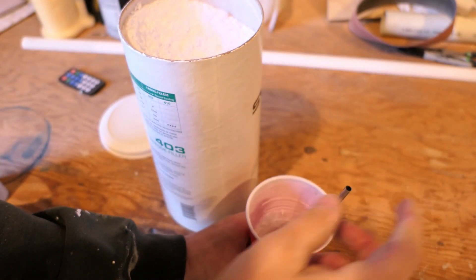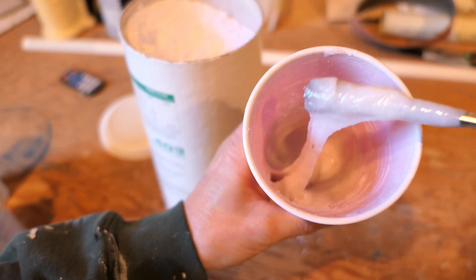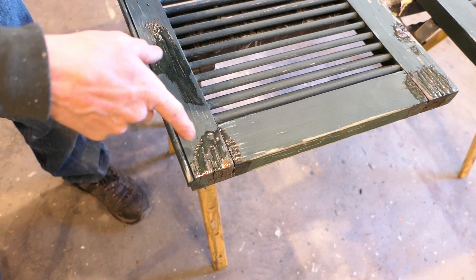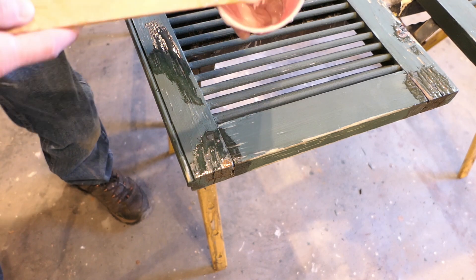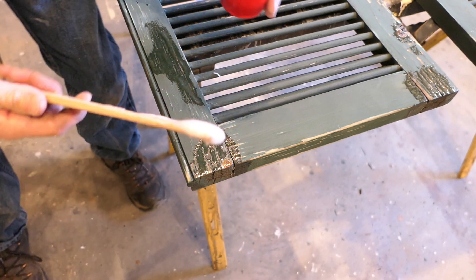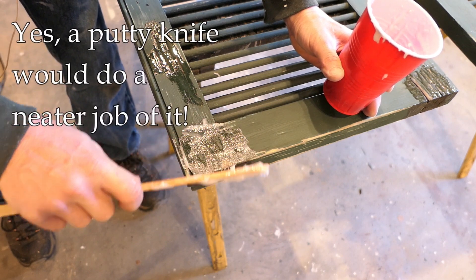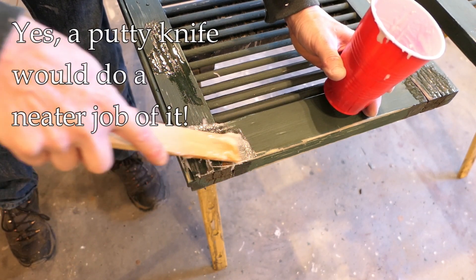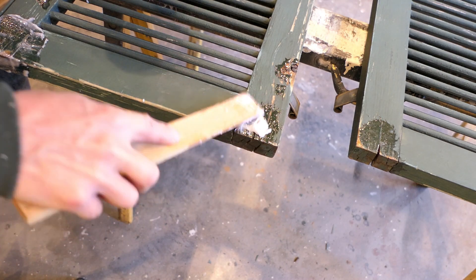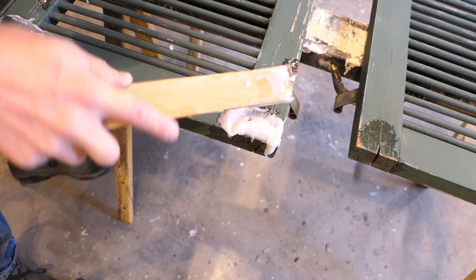I want a little thicker yet — let me add some more. Now we're getting close to what I need. I've already primed this with the more liquid version, so now I can take a wooden shim and force the thicker mixture into the joints. This is going to act as a filler so we don't see the cracks after we paint. It's still pretty sloppy but I'll smooth it out as best I can, and it will sand fairly easily when it cures.